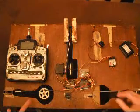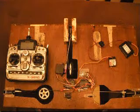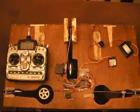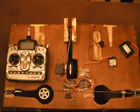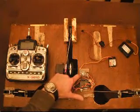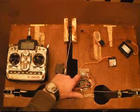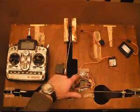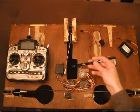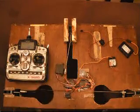What happens now is the device goes through all of the servos and puts them in what it thinks is the down position. As each servo comes up, you press the button to lower them down if needed. So you can see at the moment — this one is correct, this one is correct, and these two are wrong. Going through them: first servo correct, second servo — correct that, third servo — correct that, fourth position is the first door, fifth position is the second door, sixth is this door here, and that's set correctly. Now you can proceed directly to setup number two.